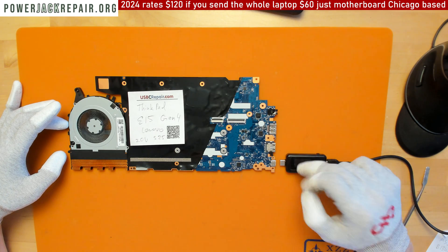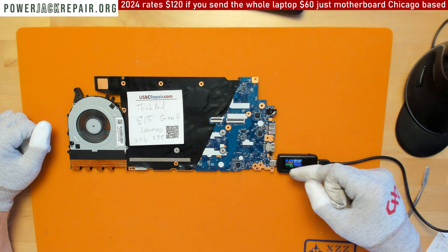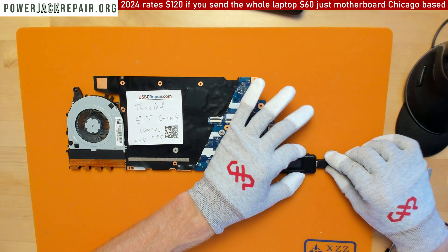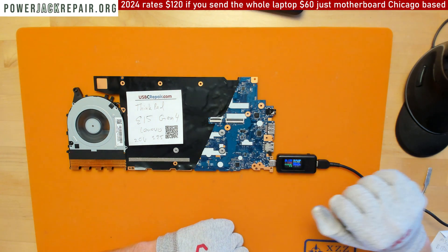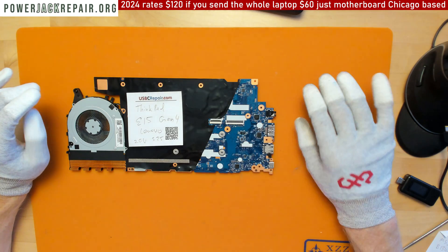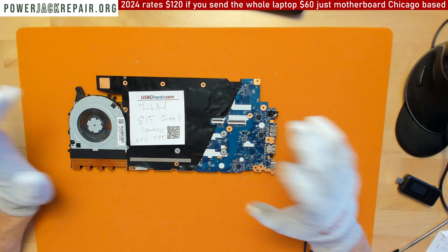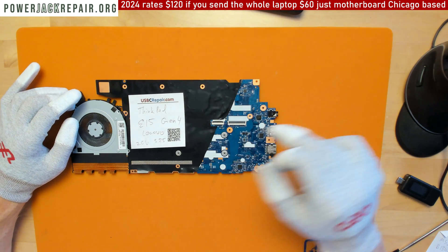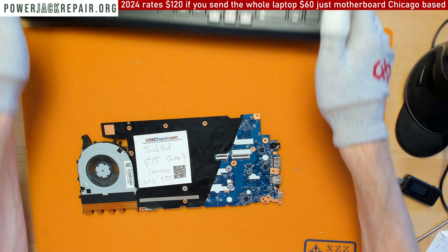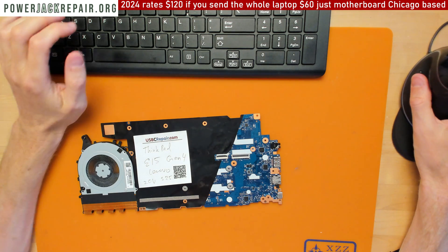Let me show you it's working. This should give 20 volts and around 0.8 amps — and we're getting 20 volts at 0.734 amps, with the fan spinning. Flipping the connector the other way, the fan is still spinning, so we're good on this board. I'll dry it out a bit more to make sure there's no isopropyl left, and that's the video. If you're somewhere without access to this repair, just replace that MOSFET and you should be okay. Please leave a like, subscribe — thanks for watching!